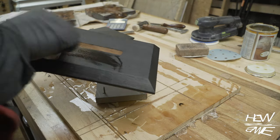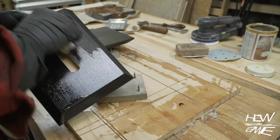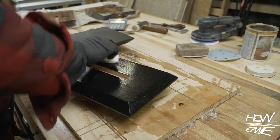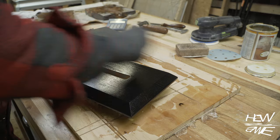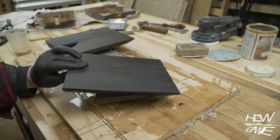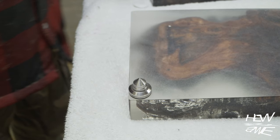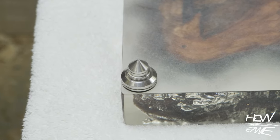Same deal with the lid, except when I went to put the finish on I realized how rough it felt. Given Indian ink is water-based, I should have sprayed the lid with water first, raised the grain, sanded it, and then put on the ink. But I put enough finish on it that it wasn't too rough, and then went over it with very fine wire wool, which didn't lift any stain. It looked good in the end — a matte finish, just like the speakers. These really finish it off — big, chunky, much better looking. I really like those.